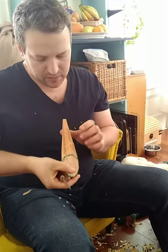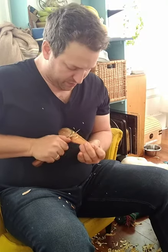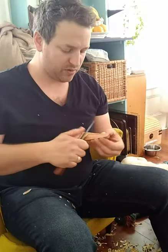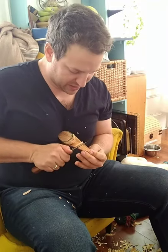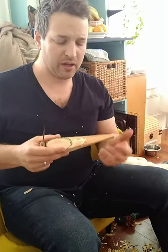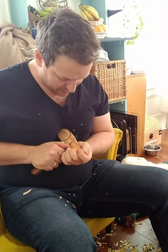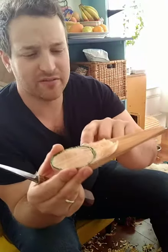And the trick is to have a nice sharp knife, and then also to make sure that you're angled this down within the grain so that your blade is just very cleanly cutting the wood and not trying to figure out if it's cutting it or splitting it at all. But by angling this down into the wood enough, you basically make it so that that cut is more likely to be clean. And by keeping that cut clean, you make it an easier cut to execute. So you'll notice I didn't try and break it all off because now I'm down in a valley here. So now I need to come at it from the other direction.